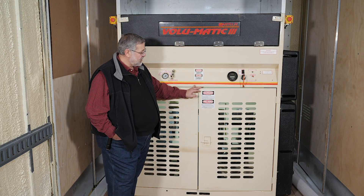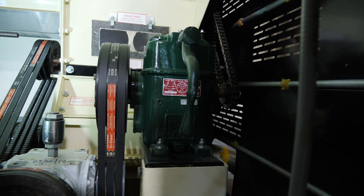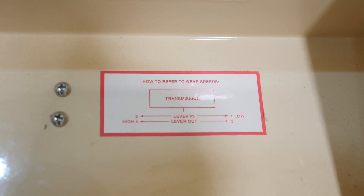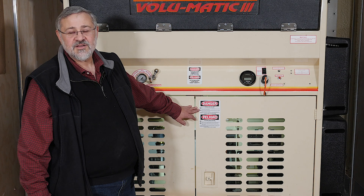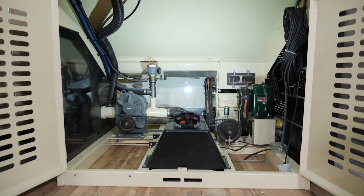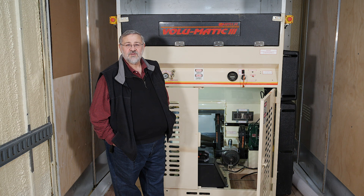The final two settings are the gear or transmission and the RPMs. You can compare the transmission and RPMs to the gears and the accelerator on your car. The transmission is normally controlled through a four-speed transmission — first gear is the slowest and fourth gear is the highest — set from a shift lever. Some newer machines are direct drives with no transmission and are set by adjusting the RPMs. Machine safety is extremely important: never enter the work area below the machine unless it is completely turned off and you have the keys in your pocket.